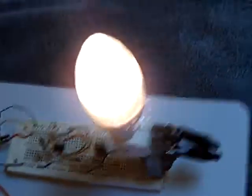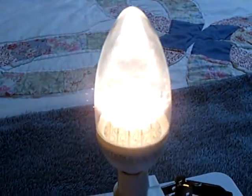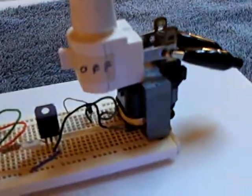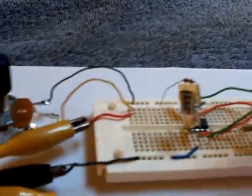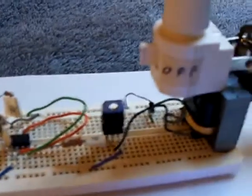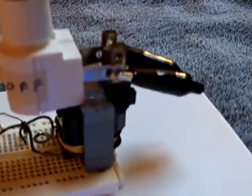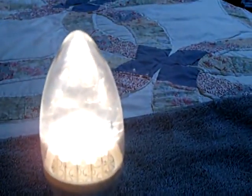This is one of these Lights of America bulbs going full blast — it's a 110-volt bulb. I'm taking the one-and-a-half volts, boosting it up to five-and-a-half, running it through a pulse width modulator 555 timer circuit, and that's allowing me to go through a transformer and boost the voltage up to the 110 volts needed to make that Lights of America bulb work.